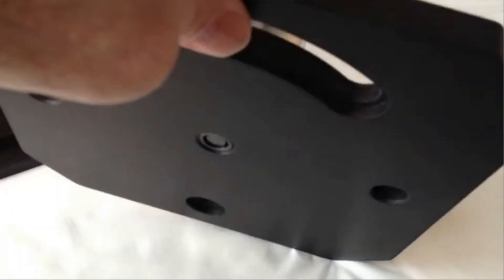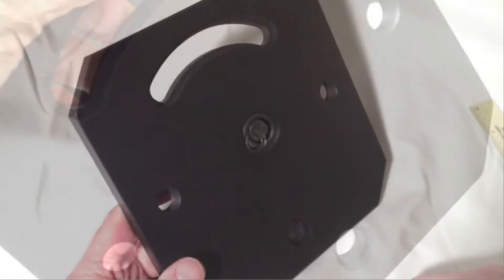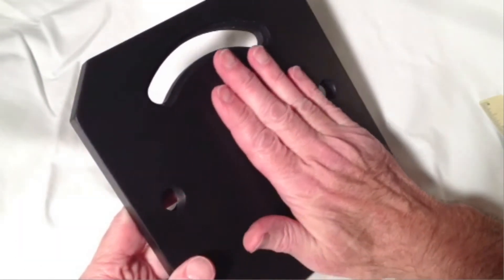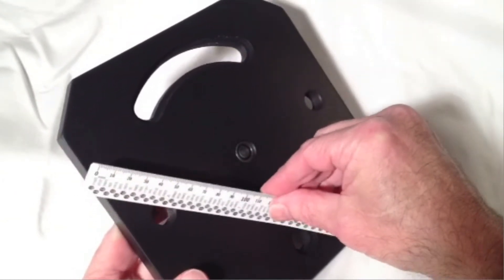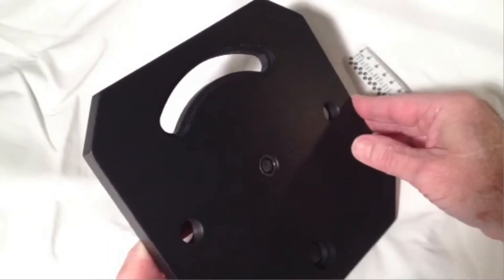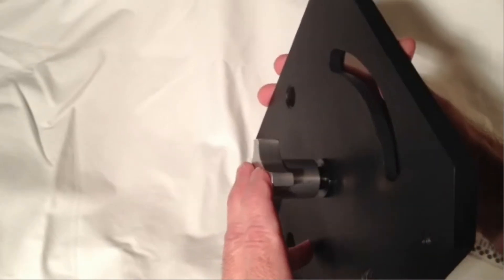Make sure the flange on the collet is tight against the surface of your mounting panel. If not, re-chamfer the threaded hole. Look at the bottom side of the panel — you will notice that the threaded shaft of the fastener is retracted into the collet. This will give you a flush surface on the bottom side, allowing you to slide your panel across the surface of your attachment plate without lifting the panel from its surface. You can also use the knob as grip handles. No tools required.